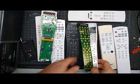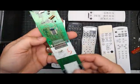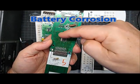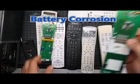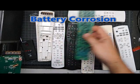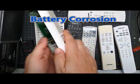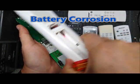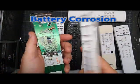This one was sent in for repair and it has battery corrosion. There's just a little bit of residue up here which we want to clean up, and the important part is the battery spring. The battery spring busted right off when they took this off. When you are taking them off, sometimes the springs get stuck. When you're pulling the board off, this person just yanked it and broke it off. This one was corroded, so it was going to come off anyway.